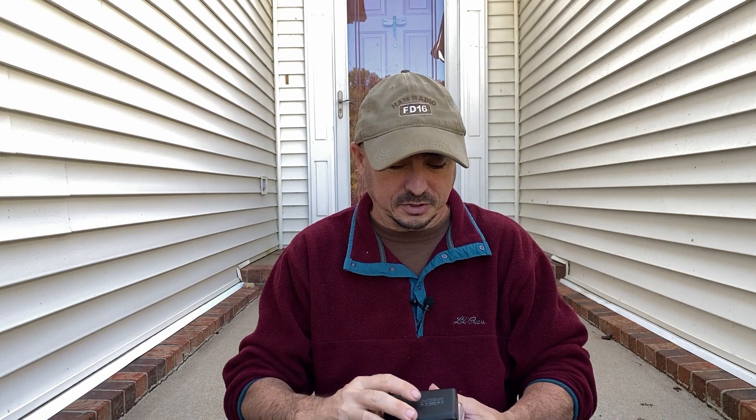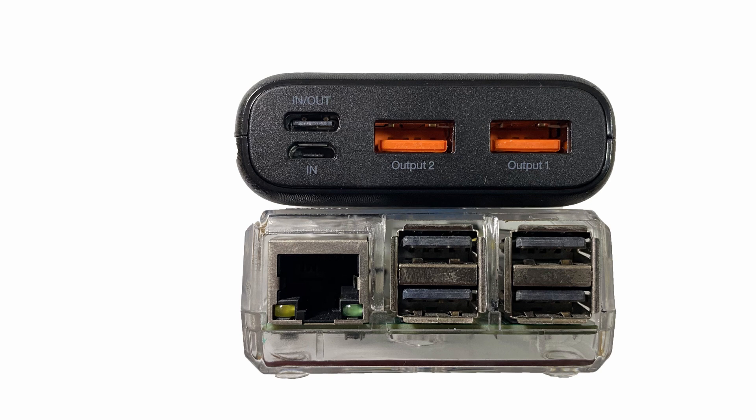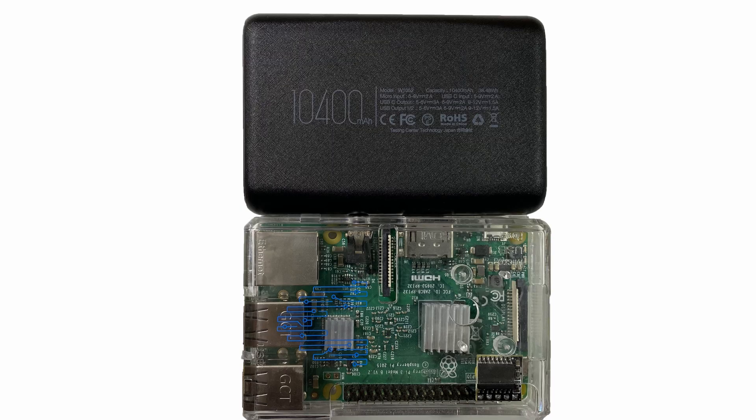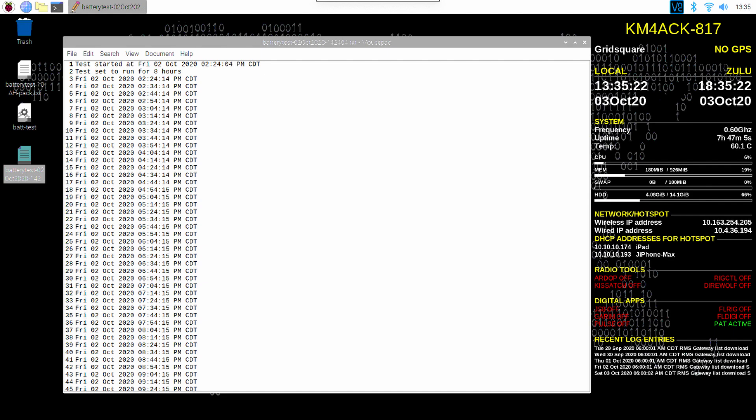This is a little cell phone battery bank. The cool thing about this one is its size — it almost perfectly matches the Raspberry Pi. The thickness is roughly the same, and when you put the two together, it matches up almost exactly. I like the form factor of it, and it's 10,000 milliamp hours. I went ahead and plugged it into a Raspberry Pi 3 and ran the script I wrote. I got eight hours of power out of that particular battery. That wasn't just sitting at idle either — I had JS8 Call running the entire time, pulling roughly about 50% CPU on the Raspberry Pi 3, and I didn't get any low voltage warnings.